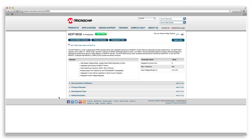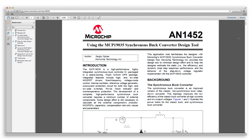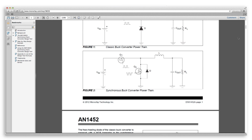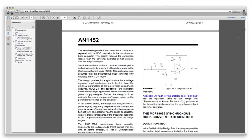If you're interested in more information on our MCP19035 family of PWM controllers, please visit the product page at www.microchip.com/MCP19035. Here you'll find the product data sheet, which describes the MCP19035's operation and performance. We also offer an Excel-based design analyzer and associated application note, AN1452. These tools assist you in designing with the MCP19035. The Excel tool automates the many manual equations needed to help you choose components and understand the transient performance with frequency domain analysis, as well as estimate the power conversion efficiency.